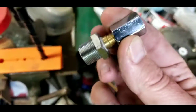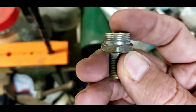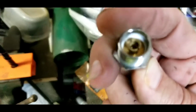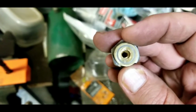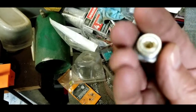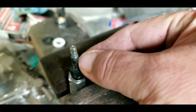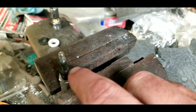What I came up with was taking this piece right here with the brass — I cut the threads down a little bit so it's flush with the brass, and you get these two little prongs out of there. Cut it down flush, drill the hole all the way through with a smaller hole — I think I went about 4 millimeter — and then a countersink with a 6 millimeter, because the antenna does have sort of a shank on it and I wanted this to sit all the way flush down.